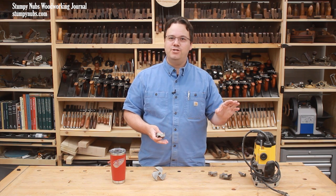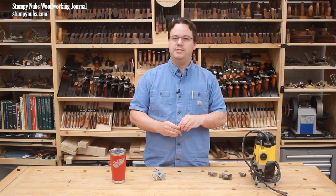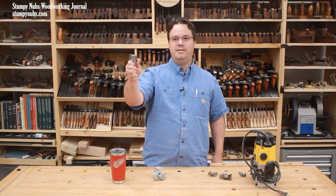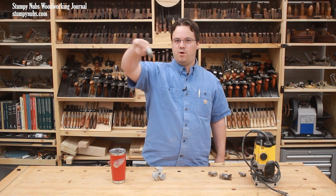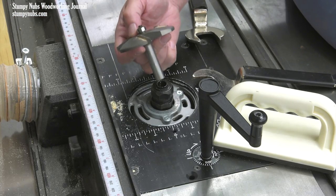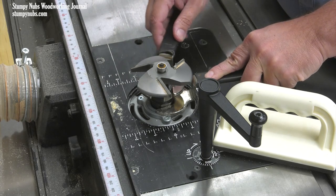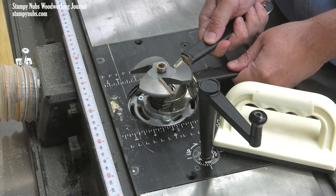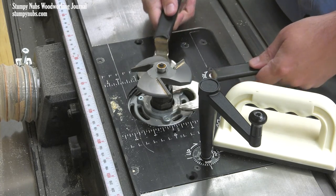You may not notice it, you may even get a decent cut, but those vibrations can cause the bit to come loose in the collet — it's happened to me. Thankfully I had it in a router table, so gravity just caused the bit to drop deeper inside the collet. But if I'd been using it in a handheld router, which is run upside down, gravity might have dropped the bit out of the collet and potentially made it into a projectile. While I generally tell people not to over-tighten router bits, I do apply some extra torque when using a large or heavy bit because of the potential for micro-vibrations if there is any run out in the router spindle.